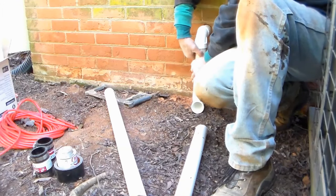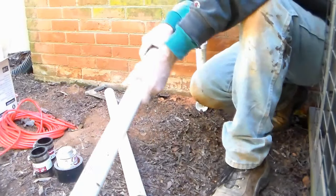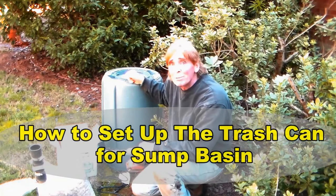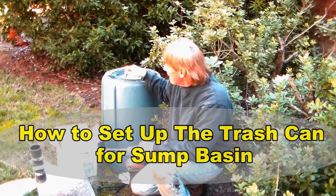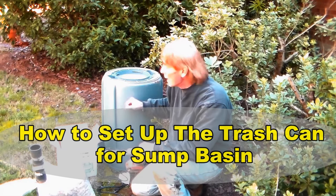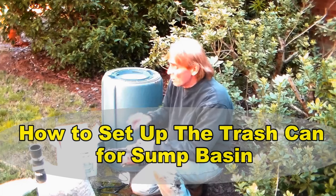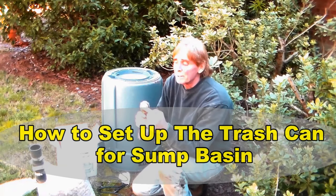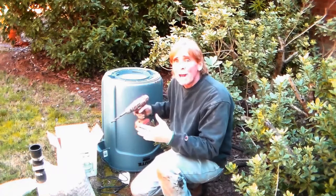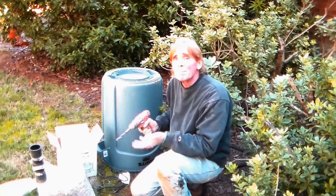Before we glue it, we always just set it up. We're going to take this piece of inch-and-a-half and hook it on to the bottom, plumbing it right out through there. This is a Hefty Brute — you get these at any hardware store, about $25, and they come with a solid lid. It's a really strong material and works exactly the same as your sump liner basin. Same size — 32 gallons, two feet deep. We're going to perforate it using a big drill, putting holes all the way around it and a couple in the bottom so it doesn't float up. We'll surround this pit with gravel, which allows the water to percolate right into the sump pit. The pump lifts it up and carries it away.